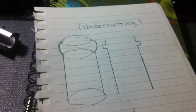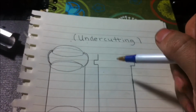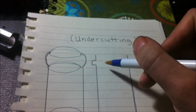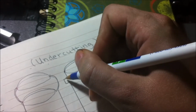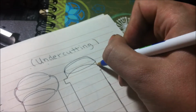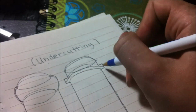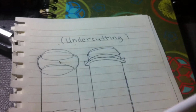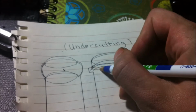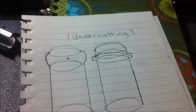That's great, and don't get me wrong, there's nothing wrong with doing it that way. But I wanted to do it more like what you would see in some ASSA locks and some other manufacturers. You basically have something like this. It's just like a groove all the way around. So you have your cylinder like that, and then you have this really nice groove all the way around. And that will catch your pins, I'd say probably quite a bit more than this would. I know it does in the ASSAs anyway. So that's kind of what I'm aiming for.